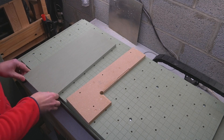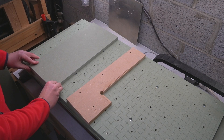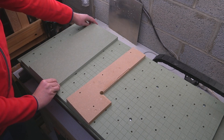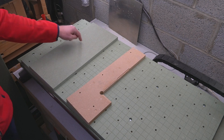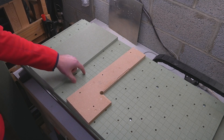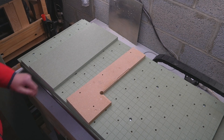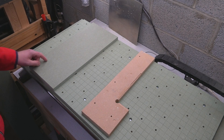We will make the new jig with this cutoff of the wasteboard that I made. There are different things we're going to do to make sure we have the best alignment possible. The first thing is that we're going to drill the holes to attach the jig to the wasteboard — with the CNC, of course. I know that I have exactly 75 millimeters between the holes in both directions, so it's very easy to create those holes and make sure they fall perfectly.